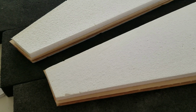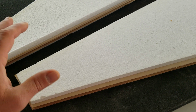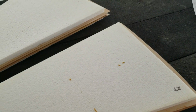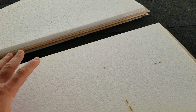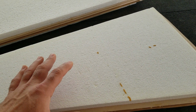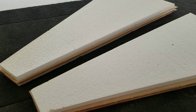Everything is set up. I got all the sheeting in place. Everything is laminated with epoxy. Spread it all out. Got everything in place, and they're loosely lined up in their beds now. So the next thing to do is to get everything positioned as accurately as we can, and then stack some weights on top and let it cure overnight and see what we get tomorrow.